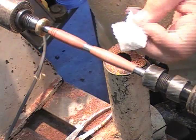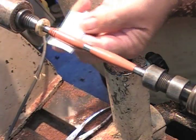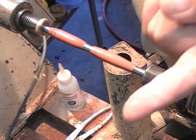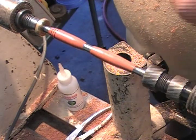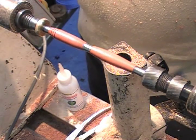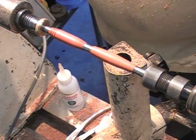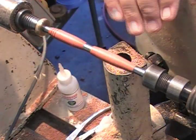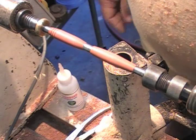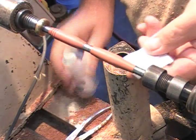Now the clock is running — this is in real time, guys and gals and woodturners. I pad it up again, get my tool rest out of the way. One drop, push. One drop, push. If I kept the bottle there and kept squeezing it'd go all the way through and stick to my finger. The problem is if my finger had a little water or a little wax on it, it'd burn me like fire. Now I'm waiting here — maybe about 15, 20 seconds. We're hard. We'll get the 800 grit buff — the burgundy is 800 — and then we come back.